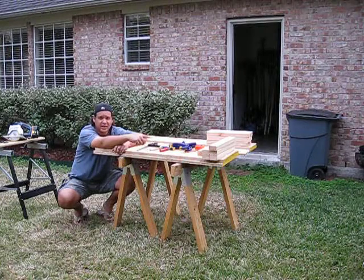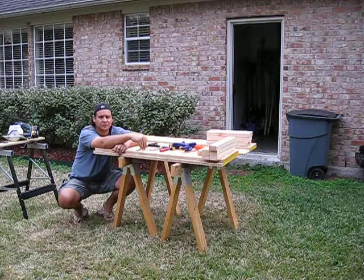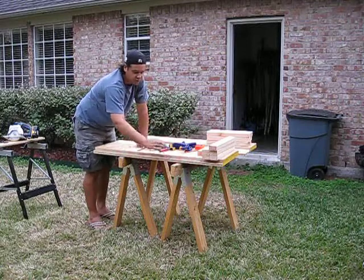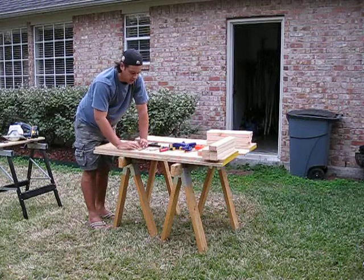The other stack of wood that you can see piled up over there are two-by-three studs. What am I using the two-by-three studs for? I'm using them to actually brace these. There'll be three strips of these two-by-three studs across here, mostly on the bigger boards, and that's what I'll be using to nail these together, just to form the square that I need.